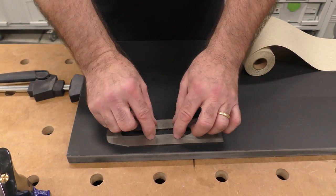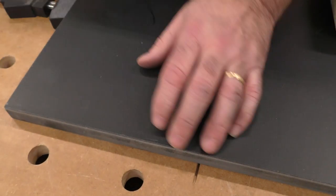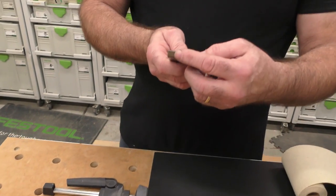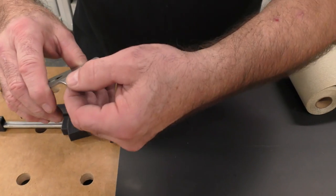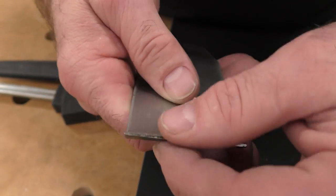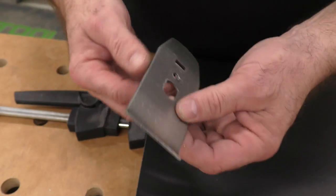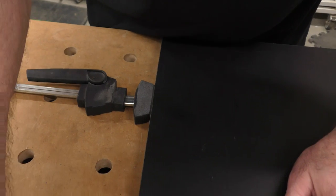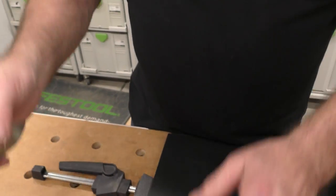I'm going to see the reaction after I get everything done — I'll lap the back. Also the cap iron: I'm feeling burrs on here. Look how coarse ground that is — it's like two bevels on there, so we've got to do some grinding. That doesn't even look square to me. You'll see how this is bent up — there's a lot of fettling we have to do.